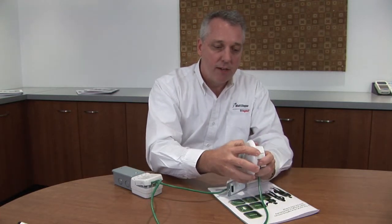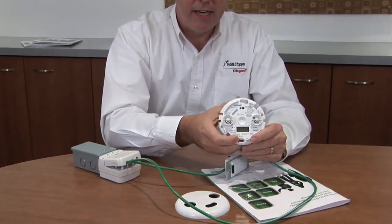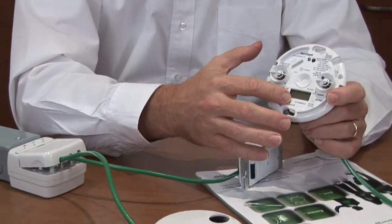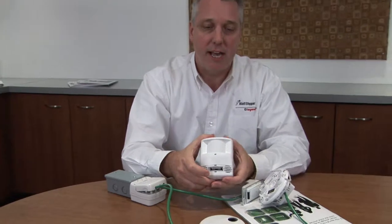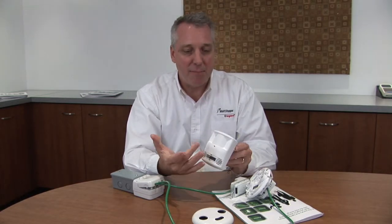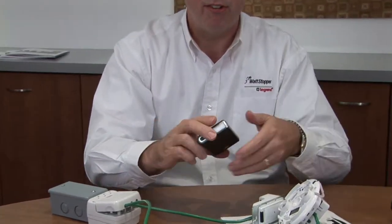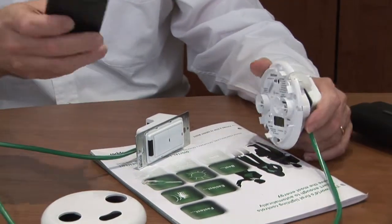Now that's just the start of DLM. Other things that are really nice about this is that it's all digital, and you know that LEED is pushing for enhanced commissioning of our systems. All of our time delays and sensitivities are digitally calibrated, unlike existing products in the field today where you're using dip switches and potentiometers to set the calibration. Instead of having to get up on a ladder and change dip switches to get the most energy-efficient sequence of operation, I can just grab my digital commissioning tool and through two-way IR communications, I just point this to the sensor I want to look at, download the data, and see what my sensitivity settings are. If I like them I can leave it alone, or if I want to change them, I can make the changes at the commissioning tool and send it right back up to the sensor.